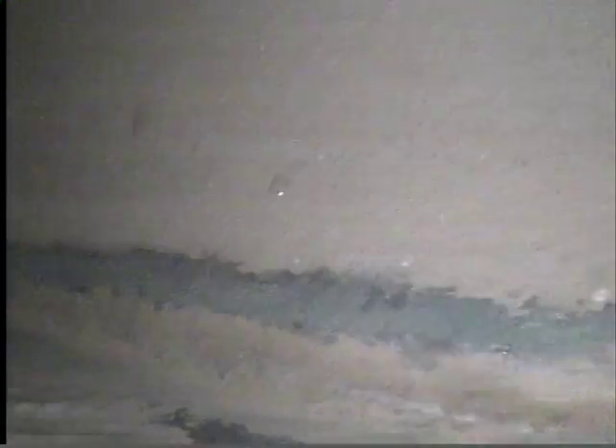We're trying to see if this is an offset break or crack — we're not getting a very good look on our monitor. Right there, that flow we're seeing right now is from the city main line. I'm going to go ahead and turn some water back on on site through the clean out.